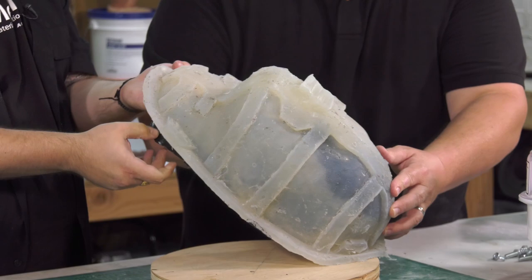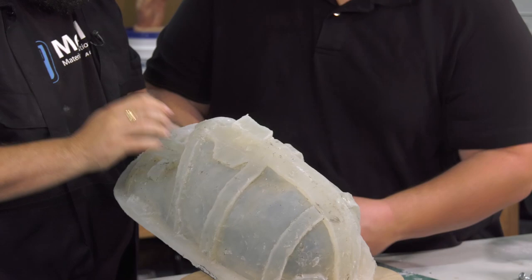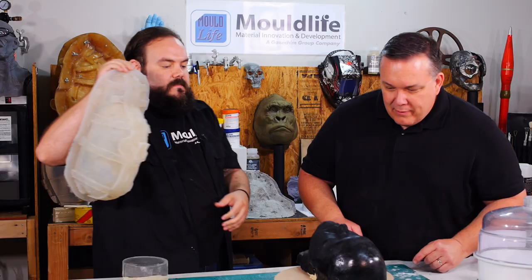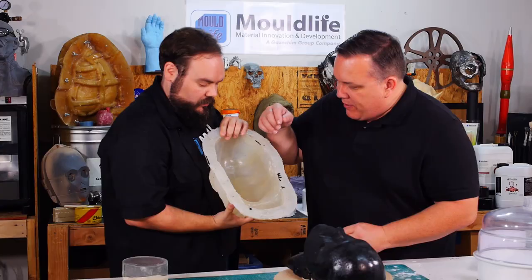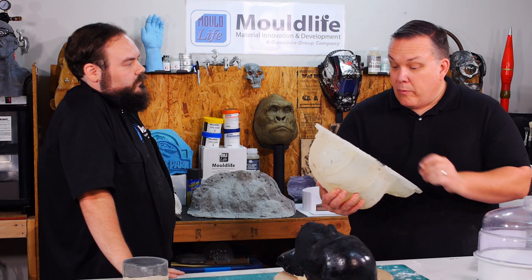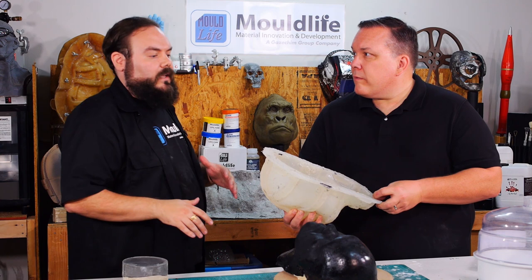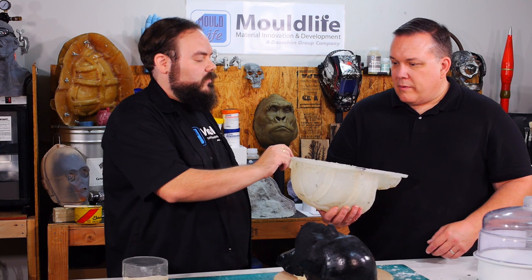Here's the other side — you can literally see the black disappear. That was actually a lot of fun to watch. Here's your life cast, and here's an exact duplicate of your head. There's still burlap texture because when the life cast was given, it had burlap pushed in too deep, and you can actually feel it in the mold — that's your negative. That's 160 ounces of silicone. The way to determine that is: the volume of silicone equals the volume of clay. Take a bucket, press all the clay into the bucket, then add a little bit more silicone to compensate for volume. The weight will be a little different because silicone is different than clay, but it's based on volume.